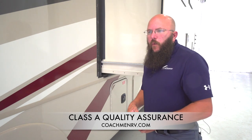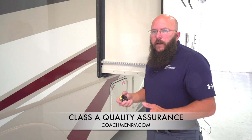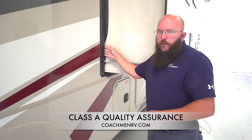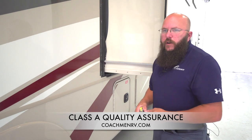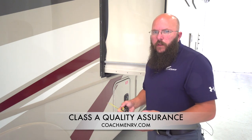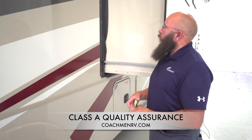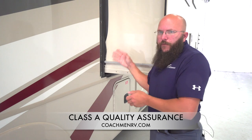Three and three-quarter inches with an eighth-inch tolerance — we don't want to push that very tight. As rooms get bigger, the drag on the system is heavier because of the weight, so we want to limit resistance as much as possible. Check that measurement on all four corners of the room, top and bottom. If you have three and three-quarter on one side, anywhere on the other side less than three and five-eighths, you're going to want more room in that slide. The same applies cross-cornered — minimum three and five-eighths on one side.